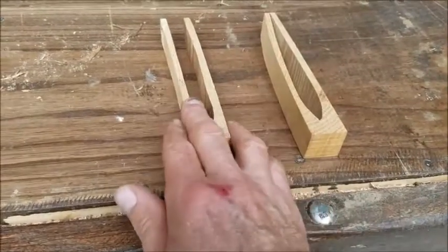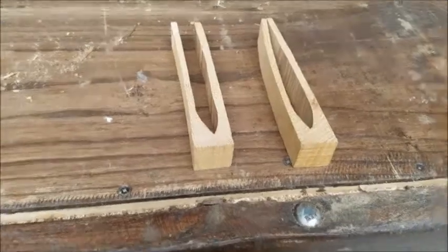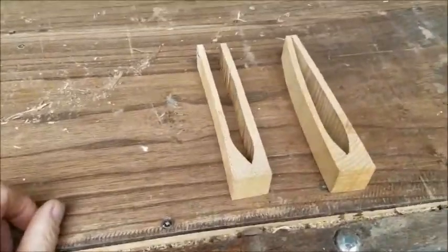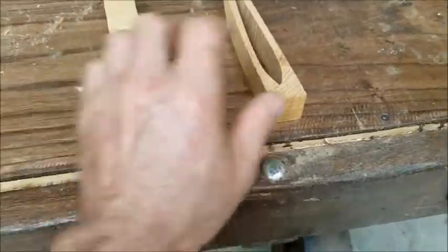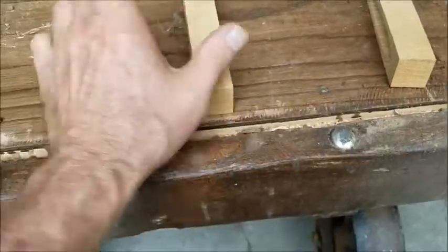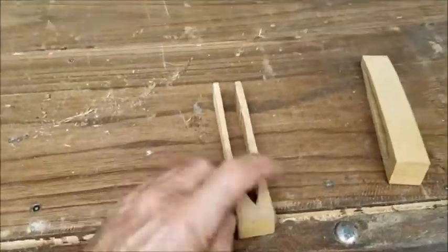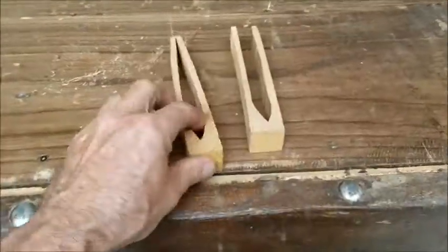Here are two shell or stress samples that you would take throughout the kiln on each load. You take a board, trim off a little bit, then cut a one-inch strip, then take it to your bandsaw and cut this shape out right here.